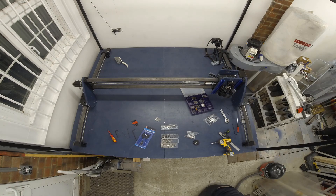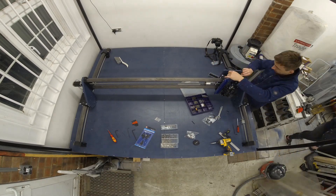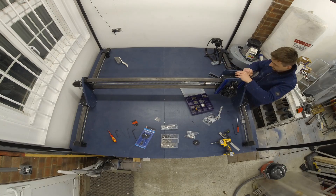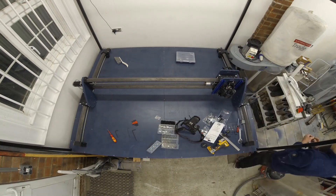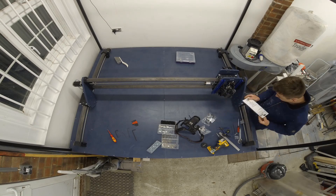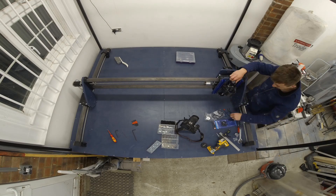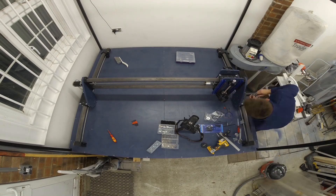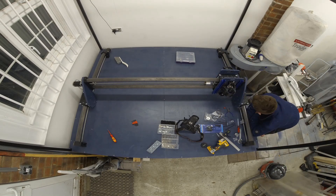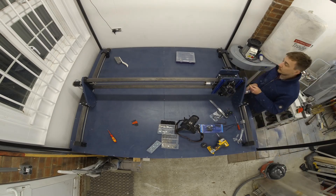Once the carriage is installed, you can see me install the z-axis motor mount. I had to go through a number of revisions, so you can see me take this on and off numerous times in the build timelapse. In the files you download, it will accommodate a wide variance of belts, as I know these can be difficult to source. The blue rails you see either side of the linear guides are for an independent height dust shoe — you'll see more of this in later videos. That's it for this video, see you in the next one, thank you, bye!